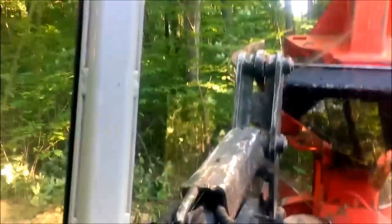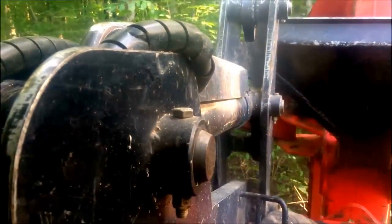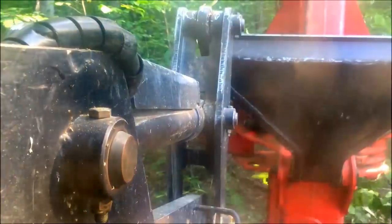But here I'm against the line. You can see a ribbon up there. And I'm looking up these to make sure they ain't got too much forward lean, because if they do, they can fall out of the jaws pretty easy. Now this is hard maple and my blade ain't the sharpest in the world. But you go in easy.